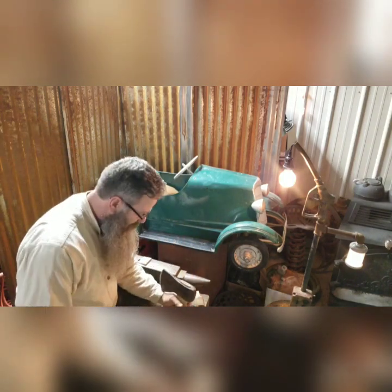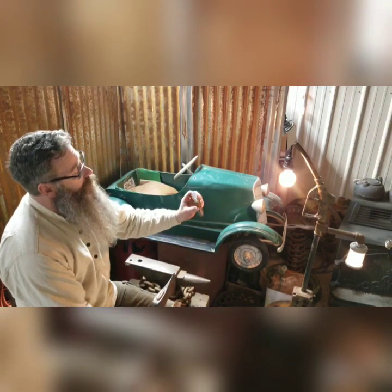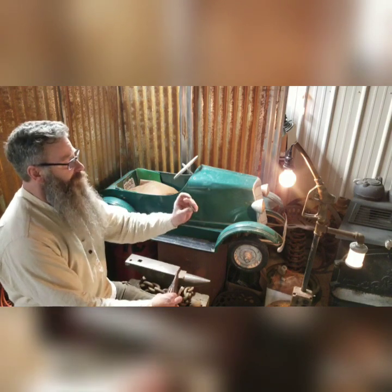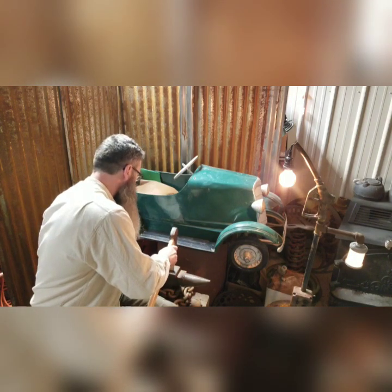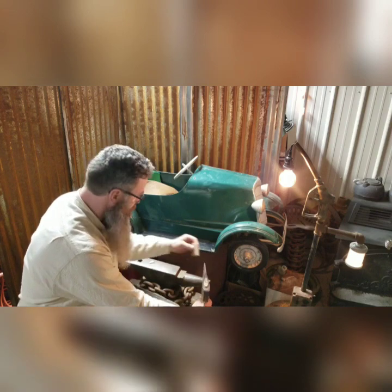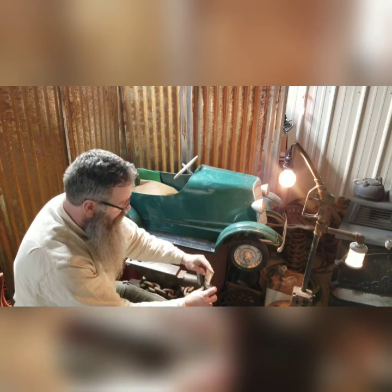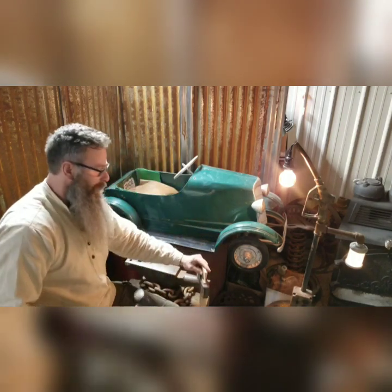Now it's time for the wedge. The older version had a traditional full-length steel wedge. The newer version I've noticed the last couple I've done — you've got a wood wedge followed up by your steel wedge. This one is already going to be a little too big, so we're going to trim it down. It was so wide it was extreme edge to extreme edge, which was going to be a problem. So we trimmed it back a little bit. Now this is pretty tight — hopefully the wedge will make it in there, if not it's going to split up real bad.